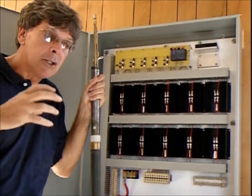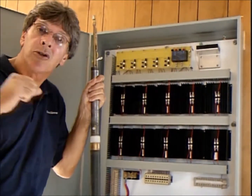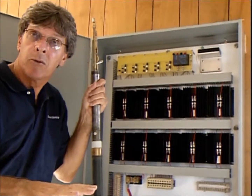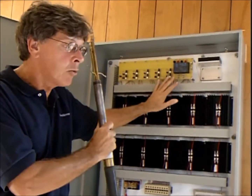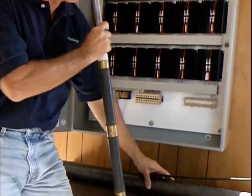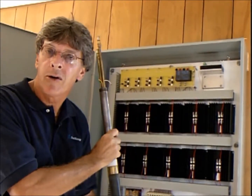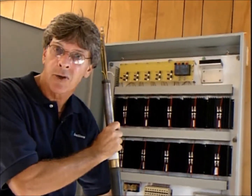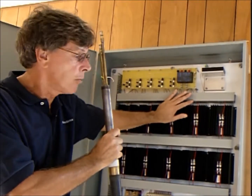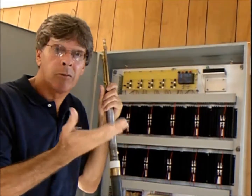And what that means is the earthquake comes along, the upward propagating shear wave tries to liquefy your soil, but the electrodes are driving the water the other way, so it can't rise, it's being driven back down, and so the ground is stable, and you don't have any liquefaction. This whole technology is to retrofit existing structures. These electrodes can be placed in the ground just like your subsurface utilities are. Very straightforward, non-invasive, and so they can be put around an existing facility, and this panel just goes basically in the basement with the batteries, and so it's a very cheap way of stabilizing a system that would have enormous damage.